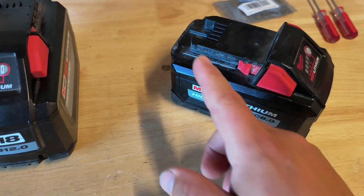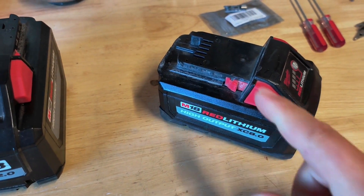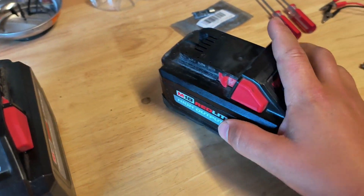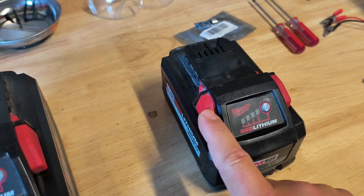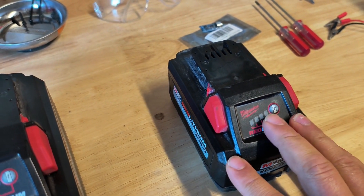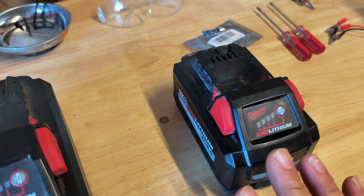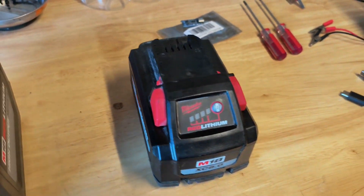But the controller is also saying it only sees enough voltage to be around the 18.5-ish volt mark. Why that's happening is because the individual stacks of cells in here are unbalanced. And because they're unbalanced and this thing has no way of charging each section individually, it says we're unbalanced — this is the best we're going to get because one of the cells in the pack is all the way fully charged, so it can't dump any more current into the rest of the pack.